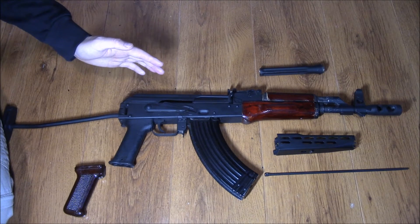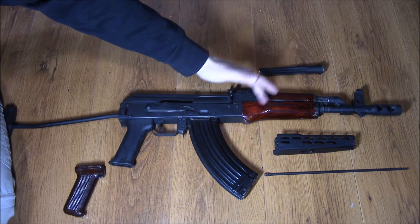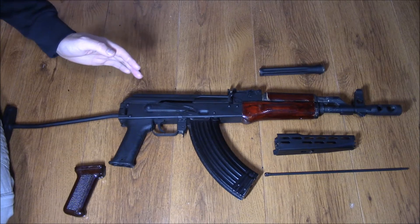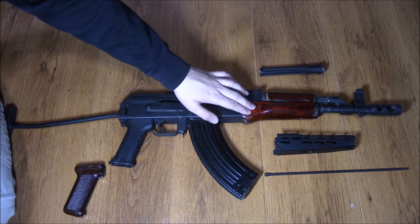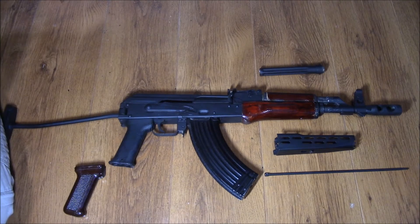With the proprietary parts on the AMD65, you simply can't bolt in or drop in these foregrips. You've kind of got to mess around with the wood, especially with the foregrip. You've got to whittle away and file away slowly until you get the fit just right.